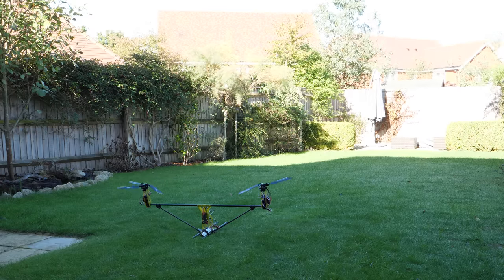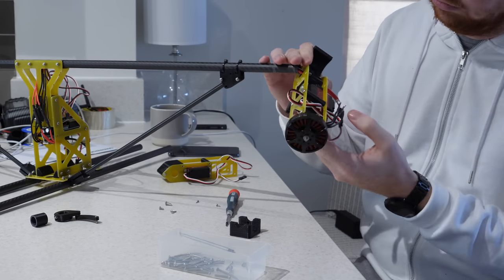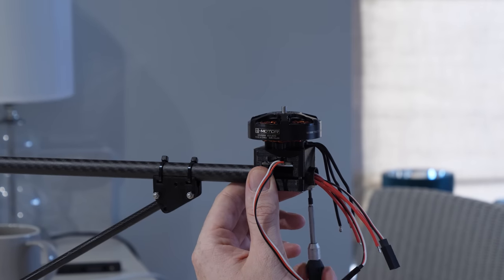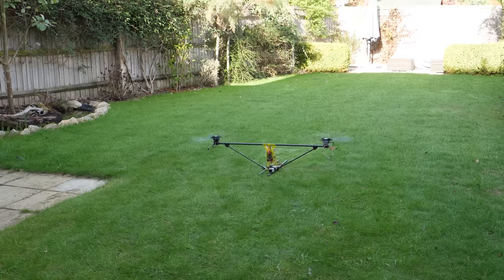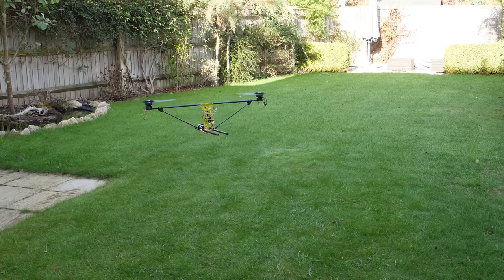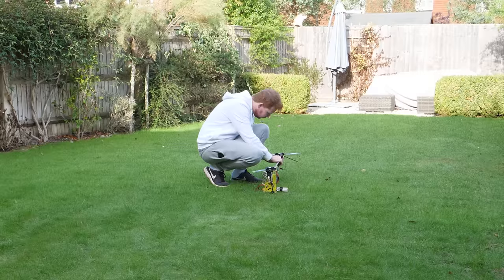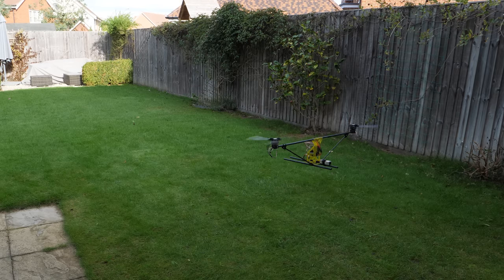So my next theory was that the motor mounts are flexing or there is play in the hinges. So I've 3D printed much shorter and stronger motor mounts, which clamp directly to the wing spar. This does, however, mean it won't have yaw control, but if it's able to hover, I'll know what the issue was. Despite the rotation to the right due to the lack of yaw control, these vibrations seem to have completely gone. So I manually twisted the motor mounts to hopefully cancel out the rotation and finally we're getting somewhere.